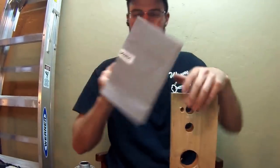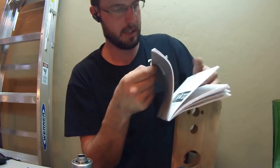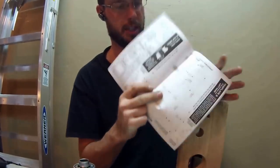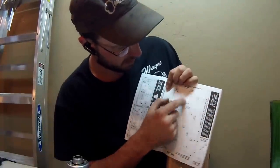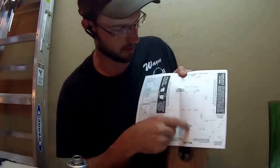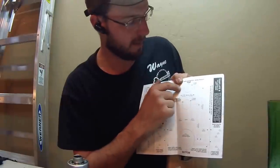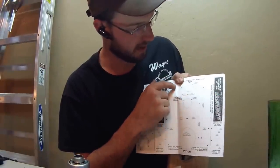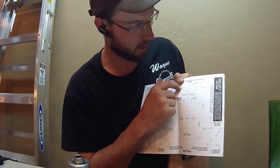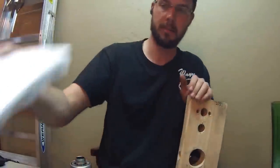First thing you're going to need to do is grab your book, and in your book you'll get this cutout sheet. You can rip this right out — that's where the main part of the lock goes through, and then these are the two holes for the bypass, the locking mechanism, and the change key. You're going to have one-inch holes here, quarter-inch holes here and there, and two and an eighth inch holes down here.